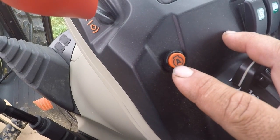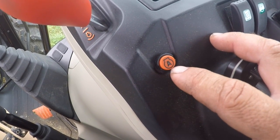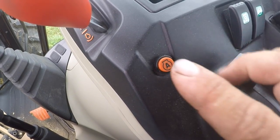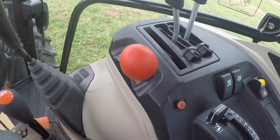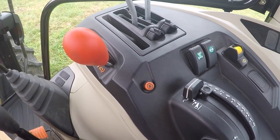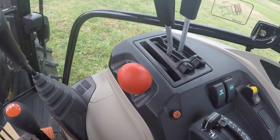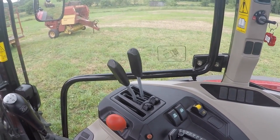It does have an auto throttle setting — I saw this button yesterday but wasn't sure what it was. Now I know: let's say your PTO 540 operates at 2,200 RPM. You can set this button to automatically take the RPMs to 2,200 RPM when you push it, and you don't have to move the throttle lever and adjust it to perfectly 2,200 RPM every time. You just hit this button, it goes to the correct RPMs and you begin your work. I like it in my T5 — it makes it a little bit easier to get going instead of having to nudge the throttle back and forth. It's just a convenience feature that makes these newer tractors a little nicer to operate.